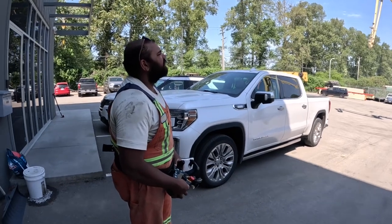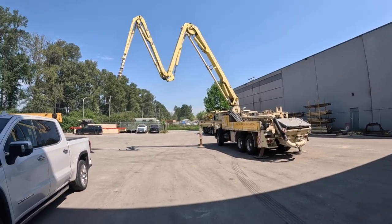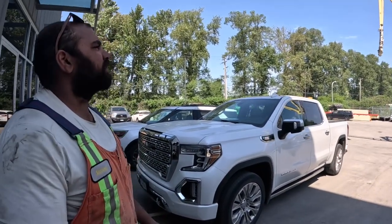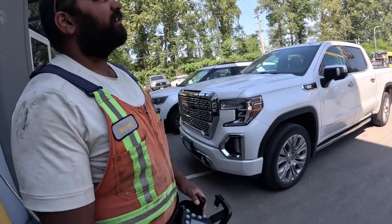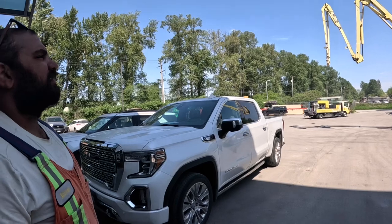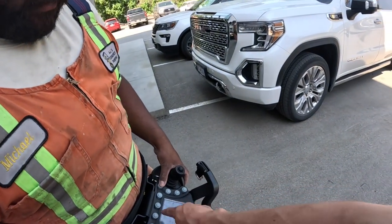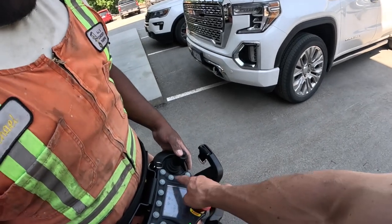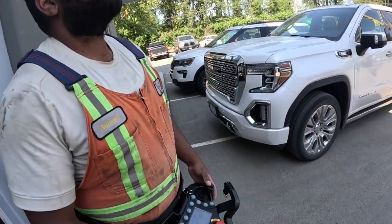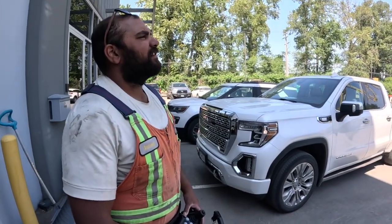It's just a turtle. We just kind of did an express setup on the boom controls, but I think they're actually pretty good. That's awesome for like walls and stuff — you do little movements, nice and slow, and when you do move a lot, on the penguin speed. Yeah, exactly. That would be great on the big booms. If you actually have it in turtle speed and then enable penguin, the first 50% is half of turtle speed, and the second 50% is full turtle speed. So if you're training an operator, you can put that on like ultimate training wheel mode — it's almost painfully slow, but to somebody who's new and probably scared of the pump, that's perfect.